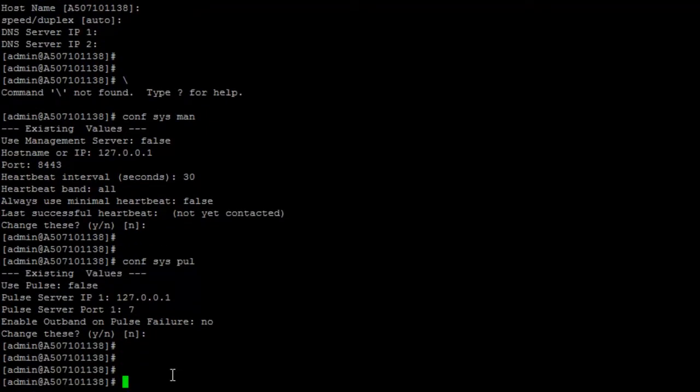Now, to get actually talking to the managed devices that you're connecting to, you'll need to get out of this top level system resource that we're in right now. This prompt says, hey, we're just in the system resource. You'll need to actually go to the specific port. Now, that Cisco 891 that I showed you just a moment ago, that is on this device on port 21. Where your device is plugged into is going to change depending on if you're using a 500 or a 5000, what kind of option cards you've plugged in. So just keep in mind this will line up with the different physical ports on the front of the device.